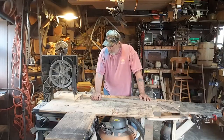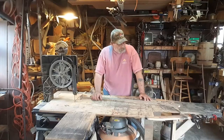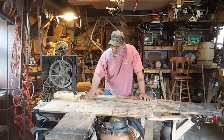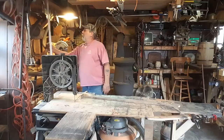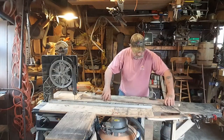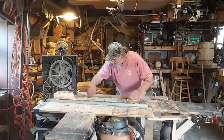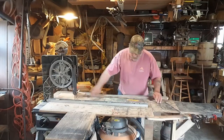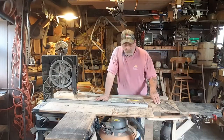That's going to give you that arc in that piece of wood. Of course, we're only taking off about an inch on each end of that board. But you got to make your taper. I usually get my line, give me a good center line. Take my level, put my level up against the blade here and here, draw me a line back. And that's going to put you dead on it.